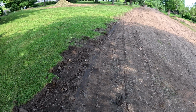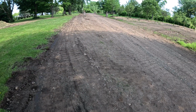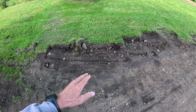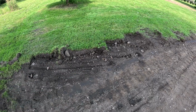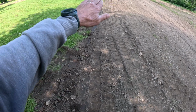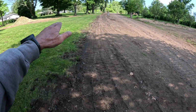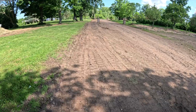So what I want to do today, and we'll see how this works, one, I do have to dress this up a little bit with the land plane, but before I do that, I think I'll use the Hulk to scoop out some more of the soil down in here so that it goes smoothly, and so it isn't such an abrupt edge, so that when I'm mowing it isn't a big deal. And either I'll take the land plane and work its way down and take down this ridge a little bit, or I'll be using the Hulk to break my way over some, because the topsoil up above gets a little bit thicker,